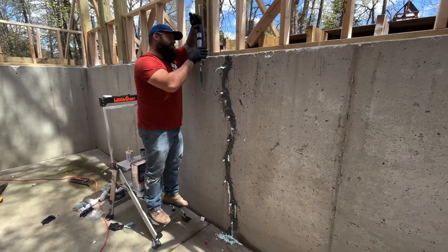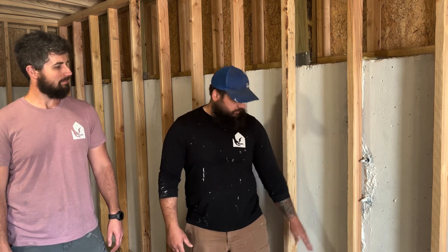It's been about two weeks since we applied this product. We're going to loop back now and see how it's doing, how it did through our testing, and what we'd do differently. The first thing: the two-part epoxy — we would have mixed that up in smaller batches, just to get a more even coat over the crack. It cured so quickly that we were having a hard time covering this length of crack.